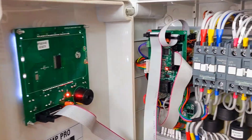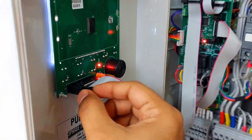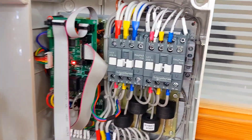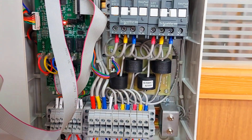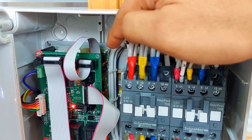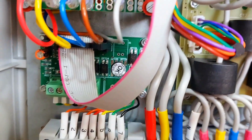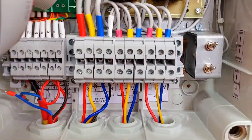Let me give you a brief introduction about the components. This is a display card — you can connect and reconnect it through an FRC cable, which is very simple for replacement in case of any fault. This is a contactor for pump on/off. This is a CT card for current measurement. This is the main motherboard MCU card, and below it is the SMPS card to provide supply to the panel. At the bottom you can see the level sensing card, where you can connect a float or pressure switch.